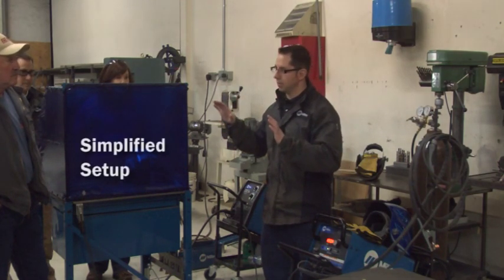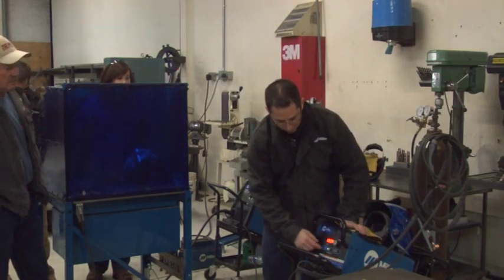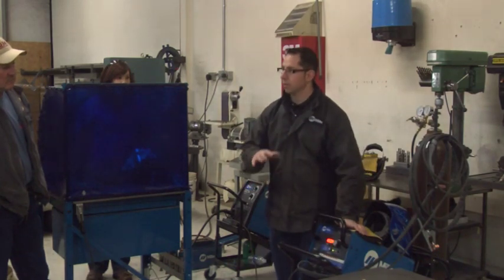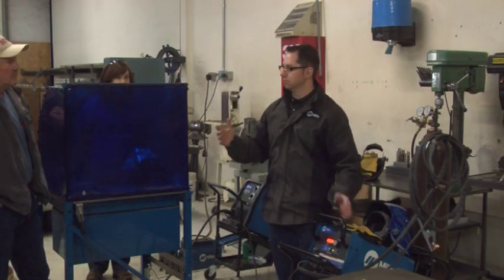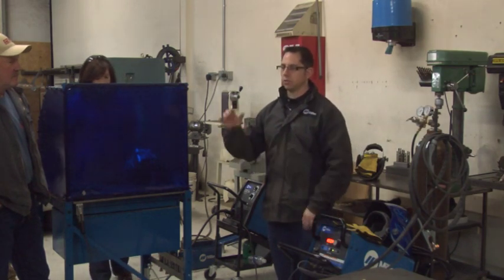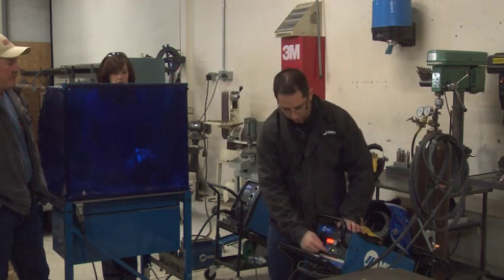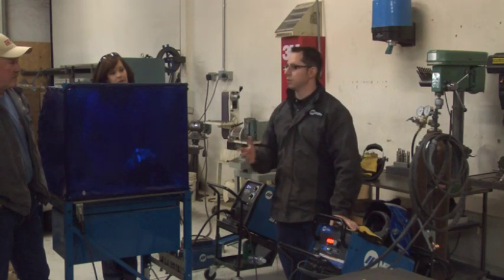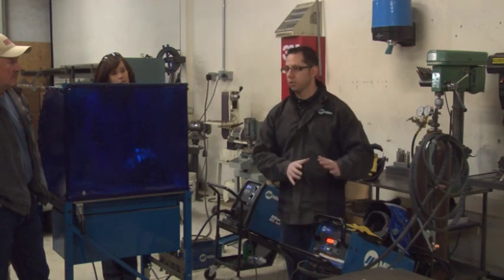As far as setting the machine up, it's that simple. For example, if we're welding on aluminum, it's just a matter of pushing the button — it lights up the aluminum side and automatically sets it to AC output. How many of you guys would have known we had to have this on AC? You may have heard that one. But how about stainless steel? Steel, stainless, chromoly — the common materials you're going to encounter in your projects — the machine is already set up to help you set the machine for those.